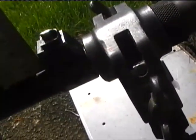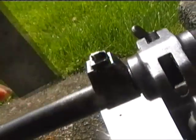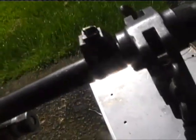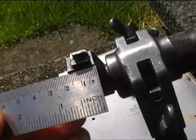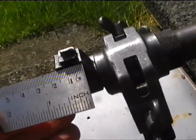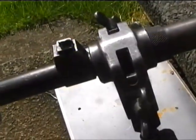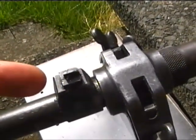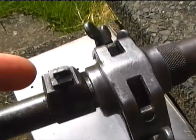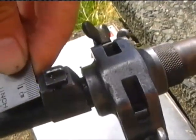That's 22mm in length there. Then you've got the height of this unit, which is 18mm high — the actual front sight. Then you've got the top section there, which is 16mm across. And the width of the metal is actually 12mm.